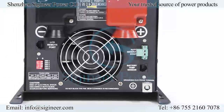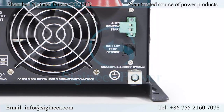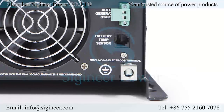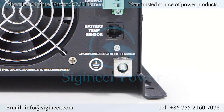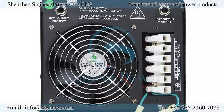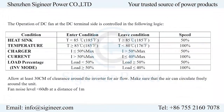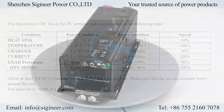The ground terminal is used to tie the exposed chassis of the inverter to the DC grounding system with a conductivity of 40 amps, eliminating hazardous high voltage in the event of a leakage. The temperature-controlled cooling DC fan is speed-controlled based on internal chamber temperature, battery charging current, and inverter output wattage, reducing fan noise and energy consumption.